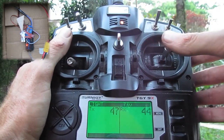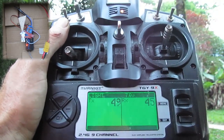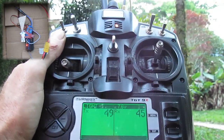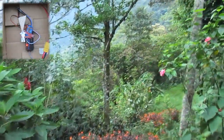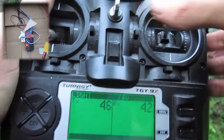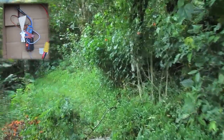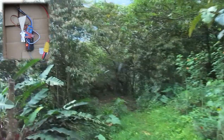It's not a huge improvement, but it's definitely better than the 38 that we had before. You'll notice that the RSSI values as I moved along weren't linear - it was down at 50 and then I went twice as far again and was only down at 40, so it dropped off quite a lot with that first bit of walking. I've run out of room to go this way, so I've got a path going down here. This is where I lost the signal before, completely, without the booster. And I've got a signal there now with the booster.